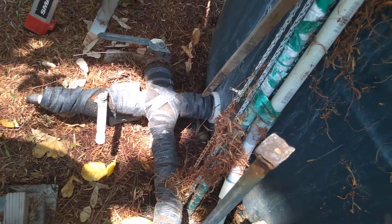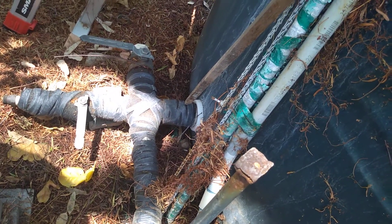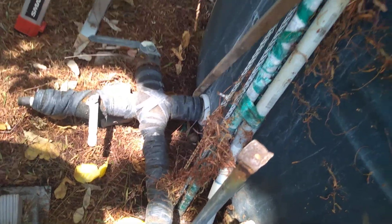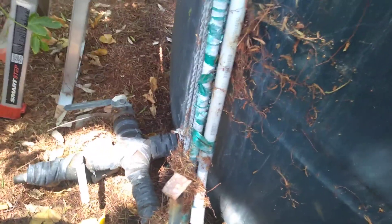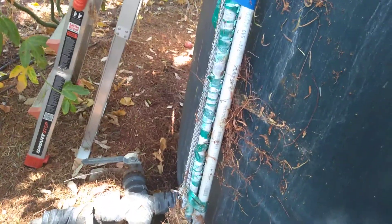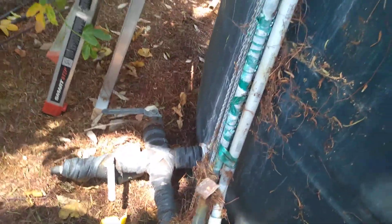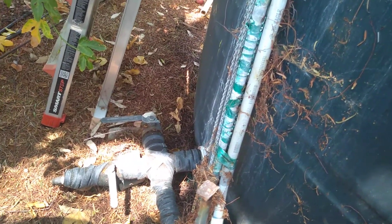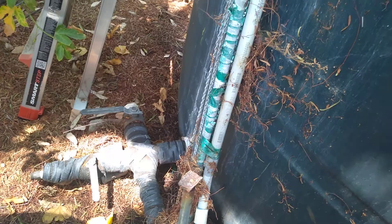If you're going to install a water well tank, a storage tank to your house, put a shutoff valve at the bottom of the tank. Like I said, haul in some dirt if you've got flat land, or if you've got a hill next to your house, you may want to put the tank on top of that hill. Install a water pressure regulator so you don't blow the pipes in your house.